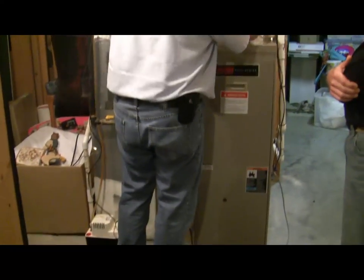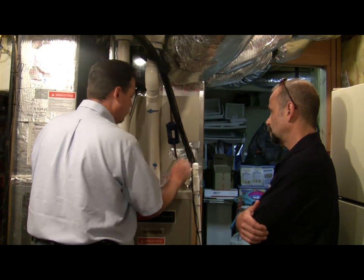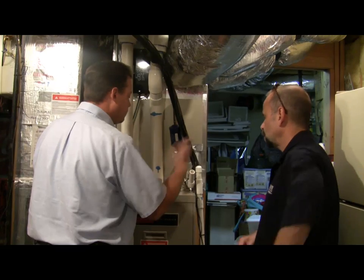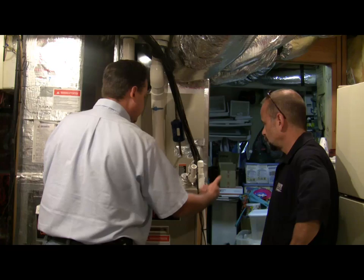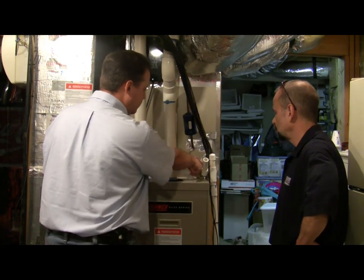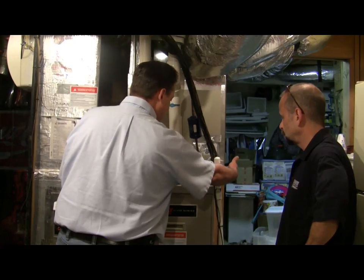There's really no easy way to get inside here to flush that pan, so I brought some stuff to show you why this is here. Right now you can see this is an overflow — this is only used if the drain pan itself cannot get the water out. Using that in another means, we're able to forcefully pour water in and flush this out. This union here gives us a chance to look inside and see if there's any debris blocking the exit of this drain — anytime you see this union, it's here to open up the drain and allow us access to look inside.